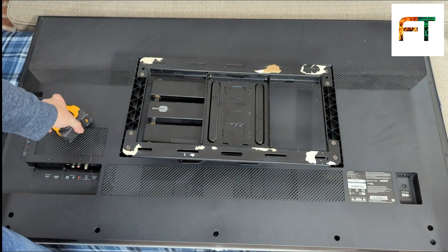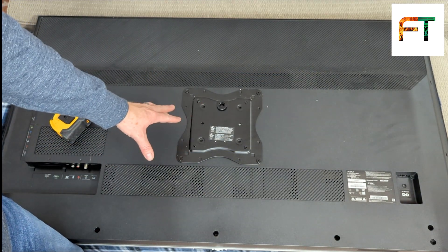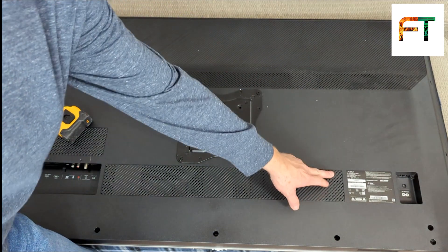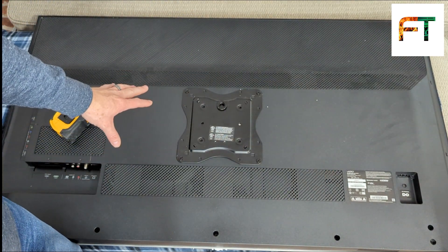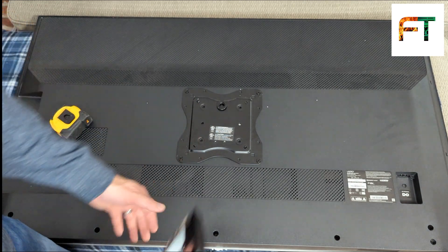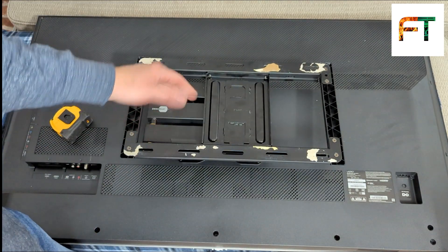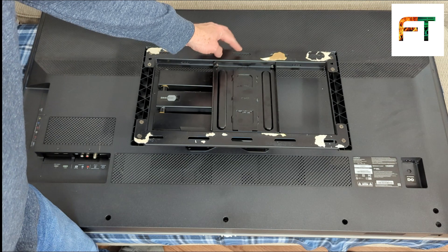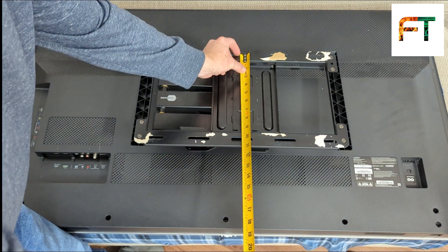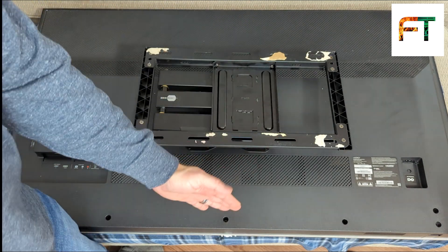What I found the best to do is to stage your wall mount on your TV. In this case, I've already applied the plate, and this particular one is a VESA mount — V-E-S-A — and it just goes in the four main holes in the center. A lot of other TV mounts will have four bolts on the outer edges. So you're going to need to look at your TV to figure out whether it has four tight bolt holes or four that are further out. Once you've got your plate on it, take your wall mount and stage it on your plate. This will allow you to get measurements so you know where the bottom of the TV should be. You want to figure out where the top mounting holes are on the bracket in relation to the bottom of the TV — in this case, roughly 17 inches.